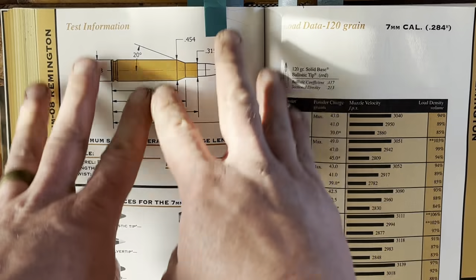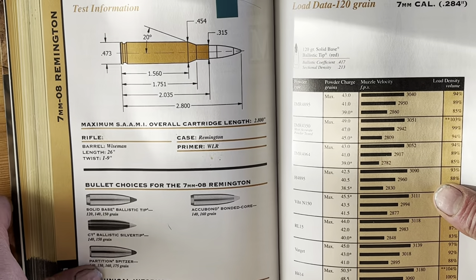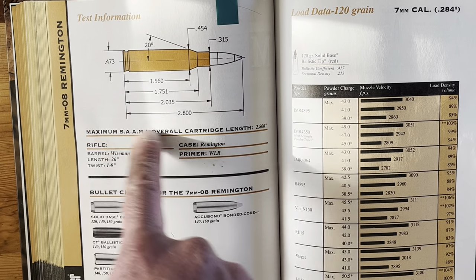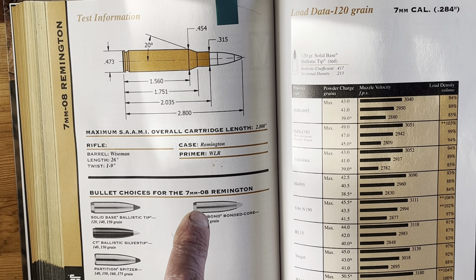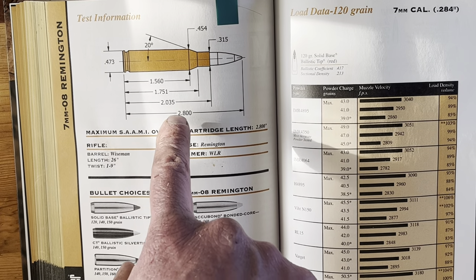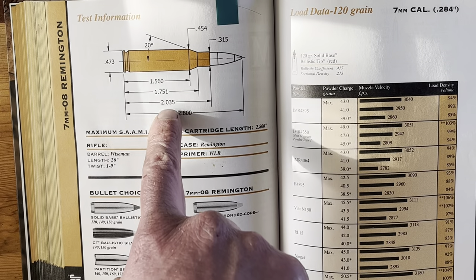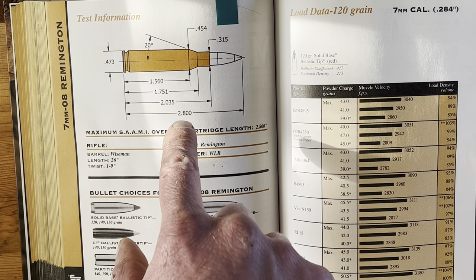On this page specifically, you'll find what bullets they offer, what weights they are, and a lot of case dimensions — these are semi-spec case dimensions. One thing Nosler doesn't do is give you a trim-to length on the case; they just give you a maximum case length. But generally speaking, your standard trim length is going to be ten-thousandths less than max — in this case 2.025 — which you will see in other manuals.